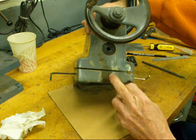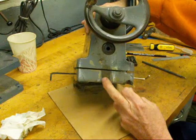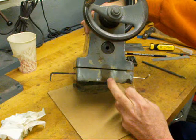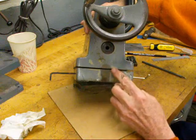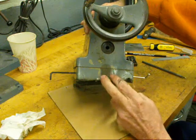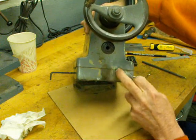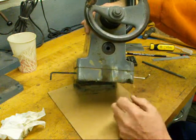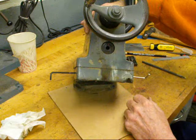So how do these get off? Well, somebody might have set it for a taper and didn't return it. Or, in the case of a school — which I spent 40 years in — there's no telling why it might be off. You better check it because students did not return them or they're only returning them by sight, and that isn't close enough. And if you're in a shop situation where you're working with other men, you're not sure who used the lathe last and what operations they were performing. If you're a one-man shop and you never change anything, this doesn't really need to be done very often.